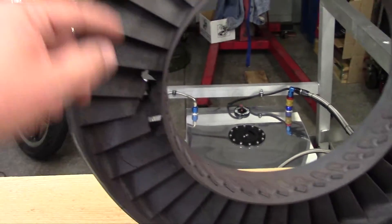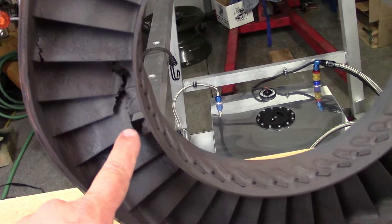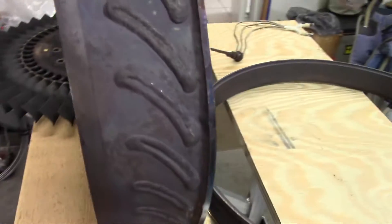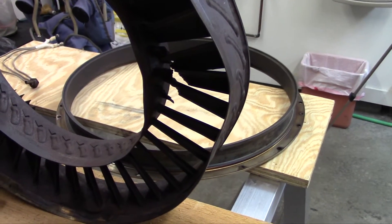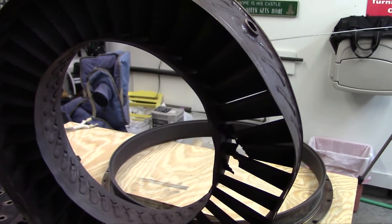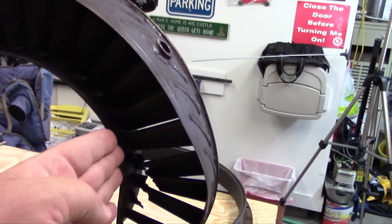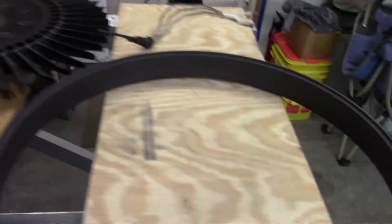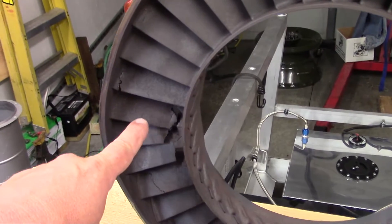You can see the damage here — it's eroding away from too much heat. On the other side you can see the severe warpage of both the inner and outer rings. This side is facing toward the front of the engine where the hot gases strike it. We're thinking it's a fuel issue, though that's yet to be determined. This part had to go — it's absolutely shot.